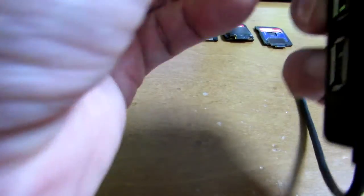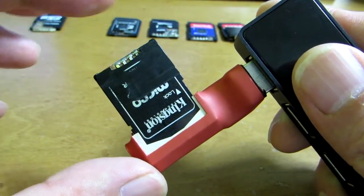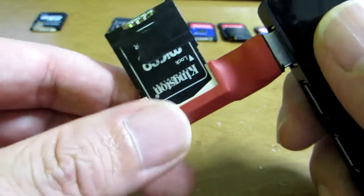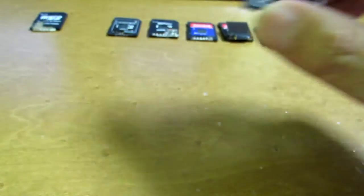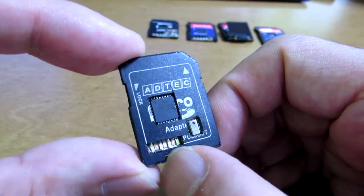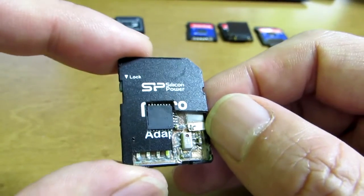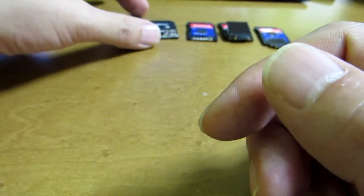By just inserting the card and connecting the USB interface, we can see the result of the uploaded binary data, shown by the LED. But just seeing the LED blinking is not so interesting, so I inserted some sensors. The initial one was a pressure and temperature sensor, with the result indicated by the LED. The second one was a piezo element inside the SD card, so this card can sing and play some music using the piezo beep.